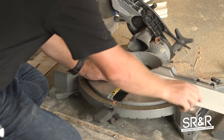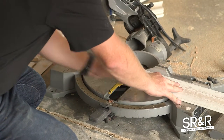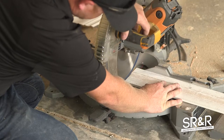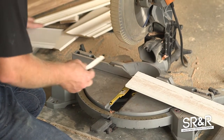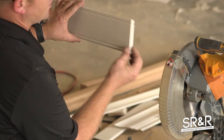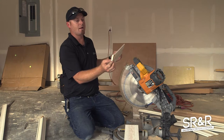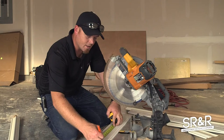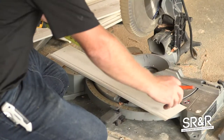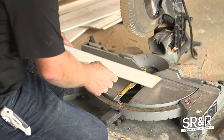Move your saw to the other side, cut that flat, flip it over, go back up to zero, and cut that flat angle back down. When you bring those pieces together you have a really nice marriage that goes flat up against the wall. Then go back one full inch on both sides — that's where I want to kill this — and get an overall measurement. In this case, it came to 23 inches, so we're going to cut that out at 45 on the inside.